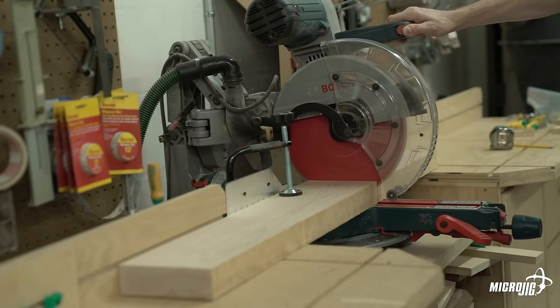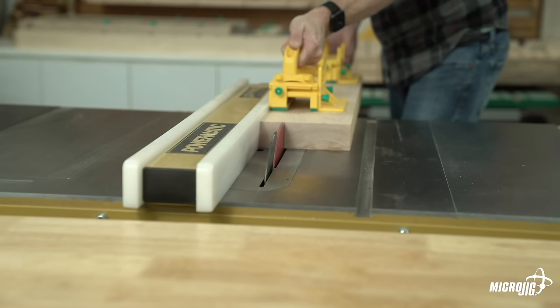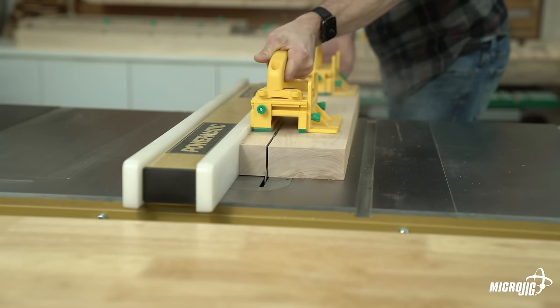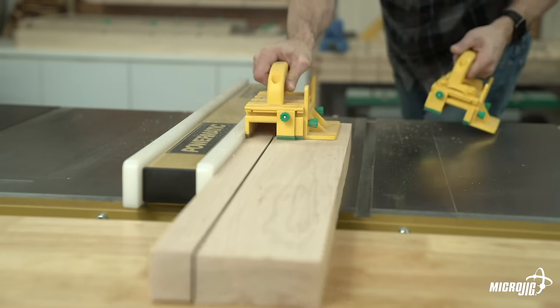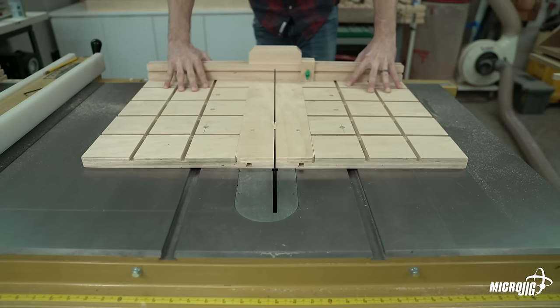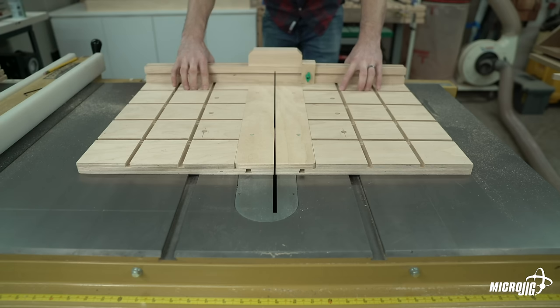Prepare a solid piece of hard maple or some other dense hardwood to finish at 1-1/2-inch thick by 2 inches wide, 30 inches long. This will be the fixed rear fence of the sled. Then cut an additional solid piece of hard maple to finish at 1-1/2-inch thick by 2 inches wide, 6 inches long. This will be the center support for the fence, keeping the two sides of the sled together after the first cut.